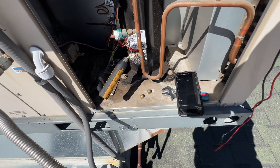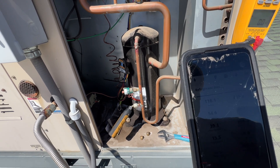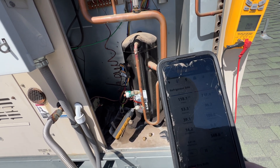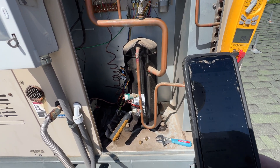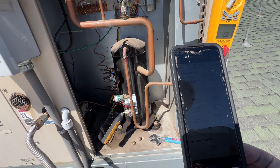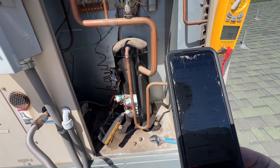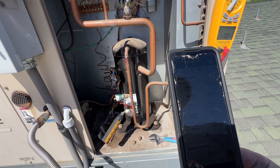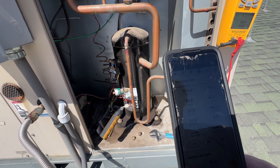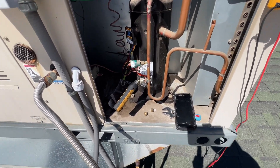I'm going to go ahead and monitor this for a little while and keep it on the discharge line just to make sure nothing weird is happening. I'll go finish my PM and then come back. It's maxing out around 350-355... it's starting to climb... 357... dropped down. Yeah, it's hovering right around 360, so we'll keep an eye on it and do a trend on it.